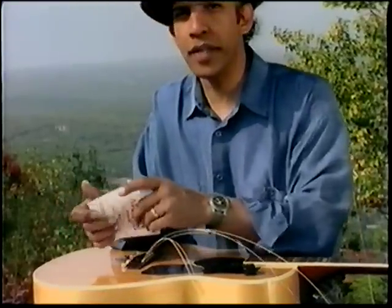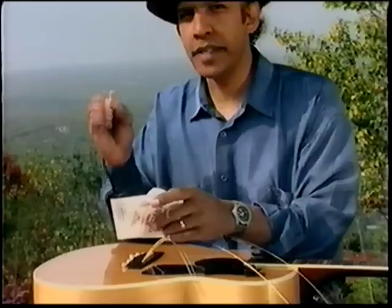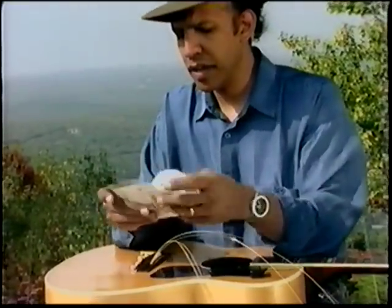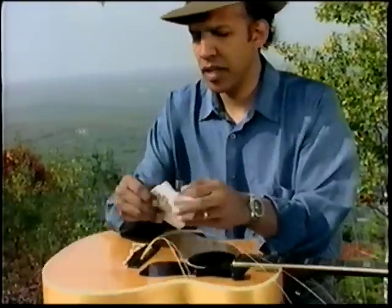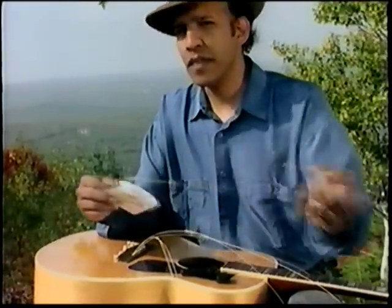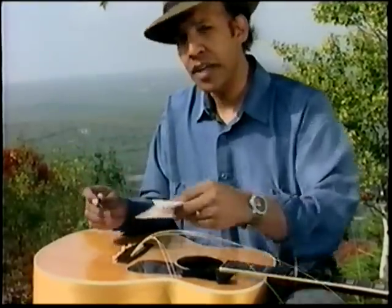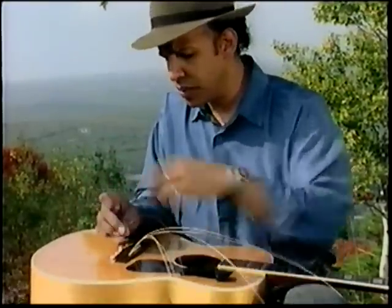It is very important to place your bridge pegs in the same place where they came out of. Different thickness strings will make a different groove on each peg. You definitely want to use the same one over and over and over.